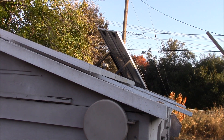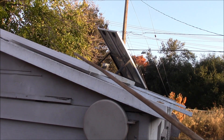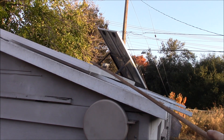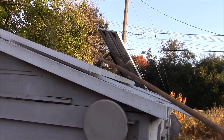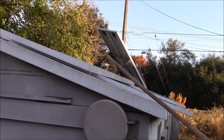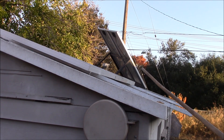Good afternoon YouTube. This is my garden shed, and I have two amorphous solar panels set up on an angle — those are the Harbor Freight panels. Right in here I've got my two old 60-watt 12-volt panels. I have those two wired in series and they're wired in parallel with the amorphous panels just to give a little more power.